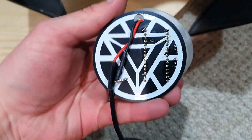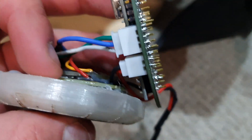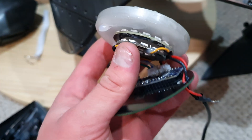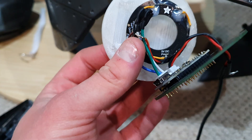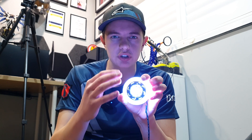All I've done is made a custom PCB with a nice little arc reactor stencil on the back, also powered by an Arduino Nano. The Arduino Nano is connected to power via this red and black wire, and then a 3-pin JST connector powering all the LEDs. For the LEDs, I've got an 18-ring module and a 16-ring module back-to-back, wired up with a little bit of hot glue so they don't fall apart, and everything soldered in and connected into the board. For the code, I've taken some firework code that gives a little bit of a flicker, transitioning between light blue, red, purple, and those sorts of colours — giving it a live feeling rather than just being one big solid colour.